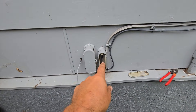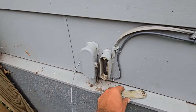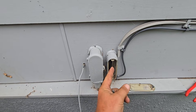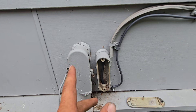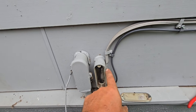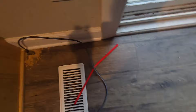Coming around, going down and up into this LB — this is called an LB. You should be able to get it at any hardware store; I believe it's a one-inch LB. Take your Phillips head screws off and this pops off. You'll have to drill a hole into your house — it is what it is — but if you want it permanently mounted and watertight, that's what you do. Put some silicone around the edges, put some paint on it, and you'll be good.